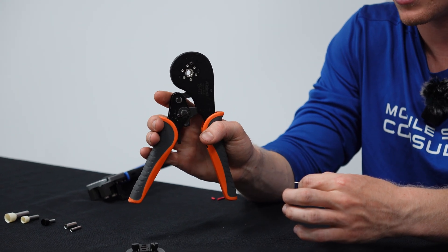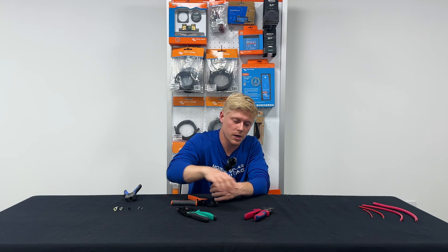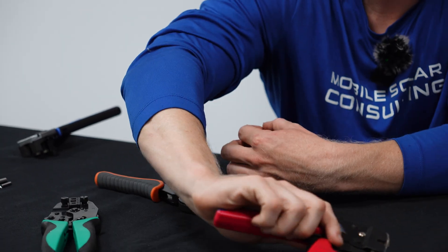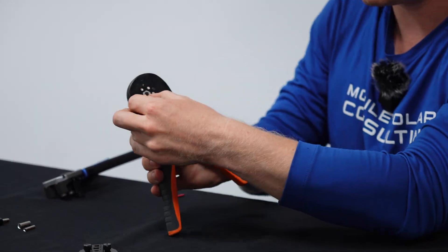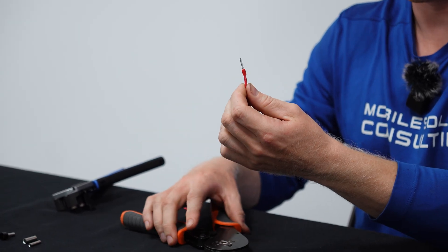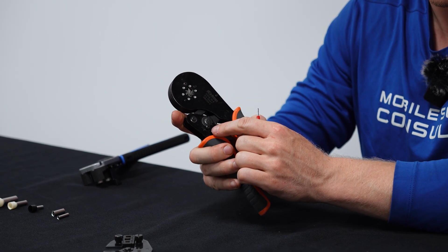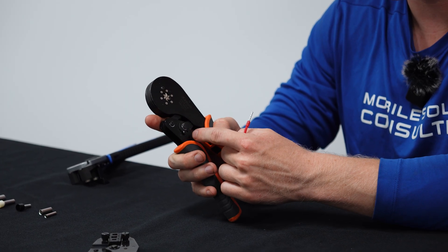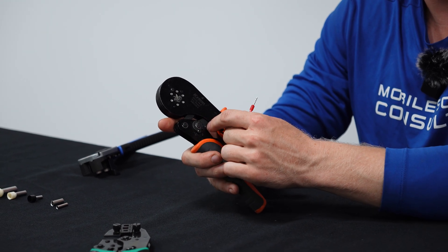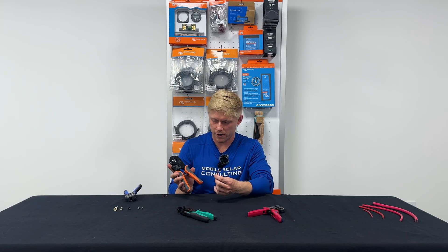That hexagonal shape will work for most items, but some items like the older 30 amp Orion TR Smart chargers are going to want a square shaped crimp, so you'd want something like this. Let's start out with this crimper — give it a tug, it's feeling good. There's also a screw here, so if you feel like your crimper is not using enough force, you can increase the tension on the spring by loosening the screw and spinning the little dial, then re-tightening the screw. These are from iCrimp — very affordable on Amazon.